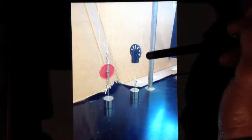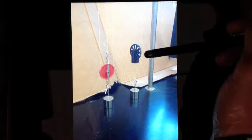On the bottom here is the key that makes it a two and a three-pulley system. I have two ropes here. Two ropes are pulling, so that's going to mean I'm getting the advantage of two pulleys. In this setup, the difference is I have a third rope right here, so that's three ropes. That means I'm using three pulleys, and that's how they'll be set up.